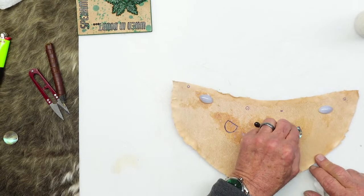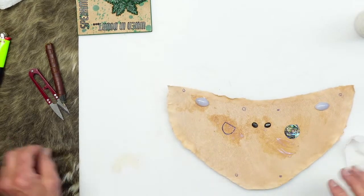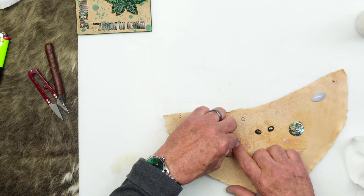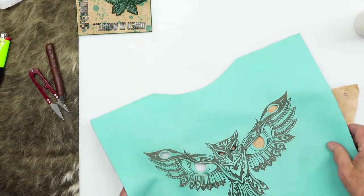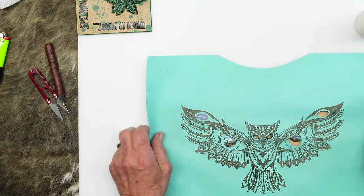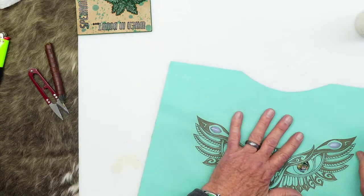And so otherwise, it's just kind of an experiment on whether or not it'll laser. Sometimes some leathers just don't look well. Like obviously, if you have a really dark leather, it's not going to show up very much. Or certain types of leather, you just have a hard time getting the image to look very crisp or good. Like a heavily pebble grain leather isn't going to engrave as nicely as something that's smooth. We do a lot of experimenting with leathers and engraving because we do have a pretty good setup, I feel like, for ventilation. The ventilation setup is good, especially back in the laser department.